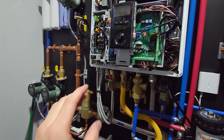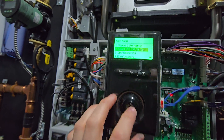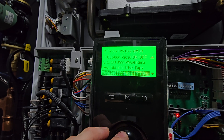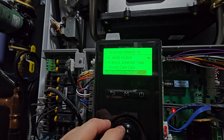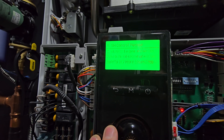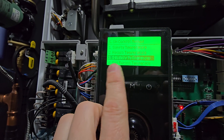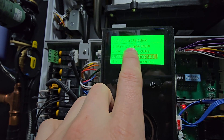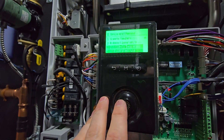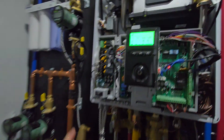The way to go ahead and do that is go into the menu here. You're going to go to Space Heating Operation, then go down to SH Control Method — that's Space Heating Control Method. It's going to prompt you on some directions, and then what you want it set for is System Supply Temperature. Notice originally it would be on Supply Temperature — that's what the boiler is supplying — so we want it on System Supply Temperature. Go ahead and click that, and you can exit back out. Now the boiler is going to look at that sensor.